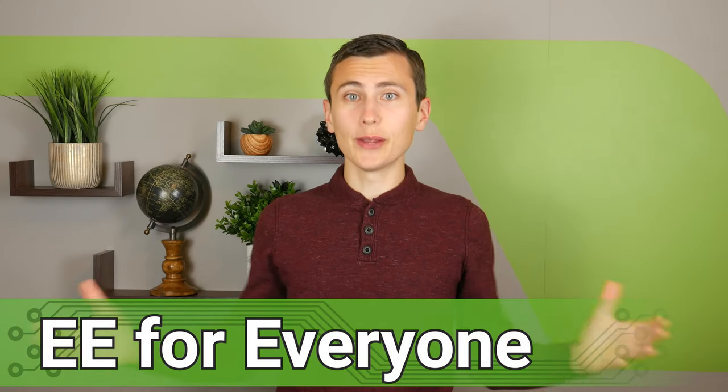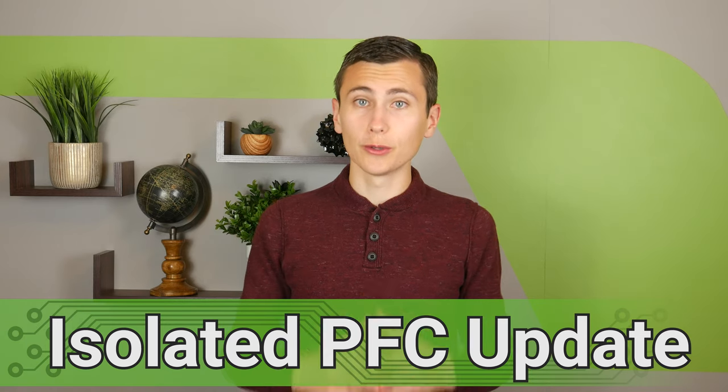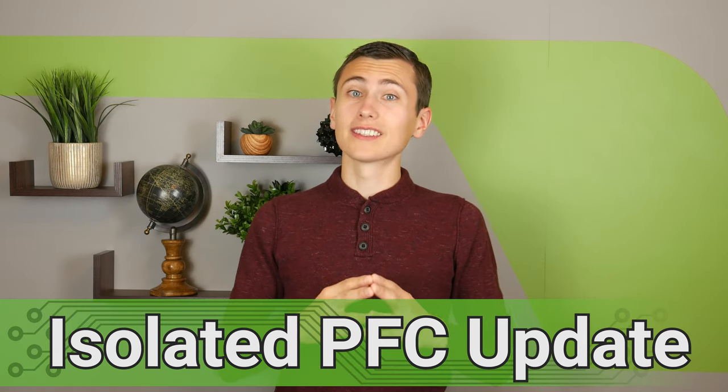Welcome back to the lab. Today we're going to solve a problem that we found with our 2400 watt UPS project. This is solving a problem we found right at the end of one of our last videos. While we designed most of a boost mode PFC switch mode power supply, the DC bus voltage of our UPS needs to be isolated from both mains and the user, and a boost mode PFC just doesn't do that at all. Isolation allows the inverter output of our UPS to be neutral-referenced and prevents electrocuting the user, and that's important.